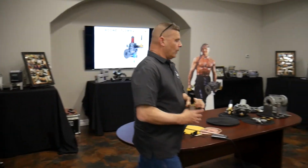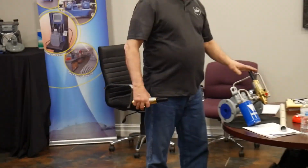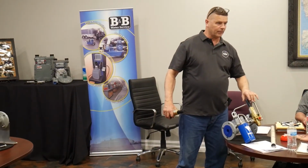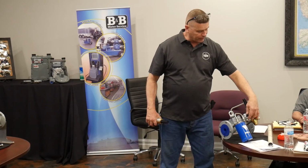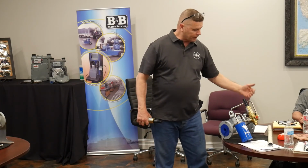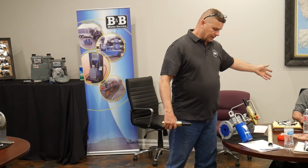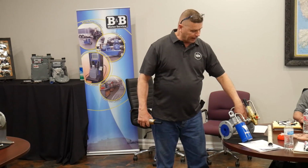Okay. Whenever you're using a working monitor, let's say this is the upstream regulator, because it's going to be double piloted. Can everybody see this? Under normal conditions, I have a restrictor on it. The outlet is for this pilot, the main pilot controlling what's happening with this regulator. Its outlet is mounted into the body.